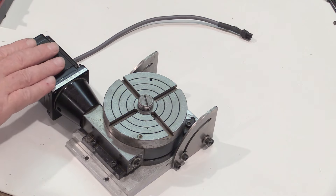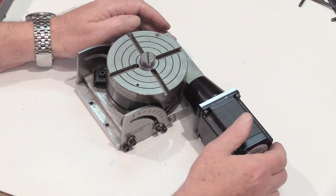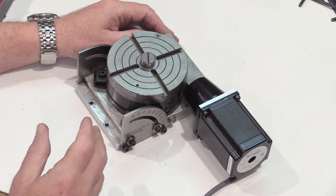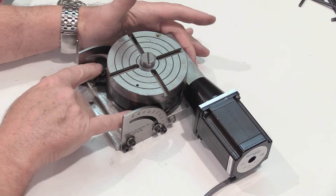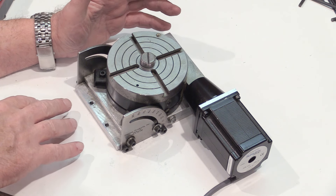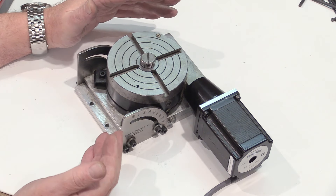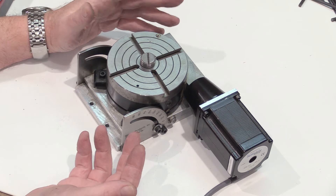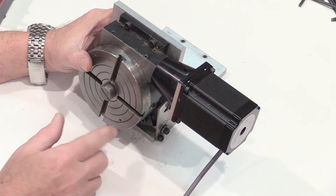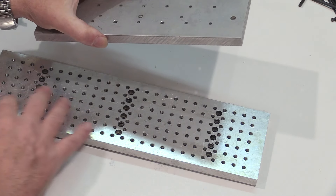You get the complete fourth axis — it also has the upgraded stepper on it, and there's a much longer cord attached to the controller so you can put it pretty much anywhere. You can mount it horizontally, vertically, or as you can see I've got it on the angle plate, which allows you to mount it at any angle you want. You can also remove it from the angle plate and use the angle plate to position other work pieces for milling at an angle. You can mount chucks on it — it's extremely versatile and very accurate. I'm also including a couple of plates I made that sit under this, with all the right screw holes, for when the diameter of your work is too big and you need to lift it off the table.